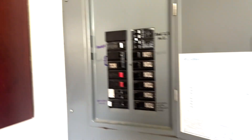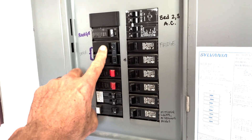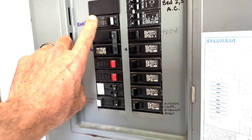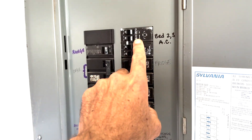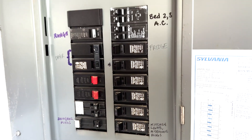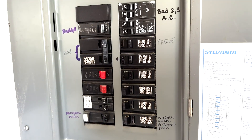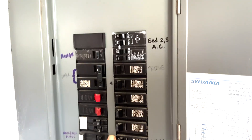You're at the mercy of charging those batteries with the sun the next day. So I'm going to show you this at a friend's house that has a system. Every one of these breakers needs to be turned off — your main loads. Switch, switch, switch. There has to be no loads on the house to do a reset.